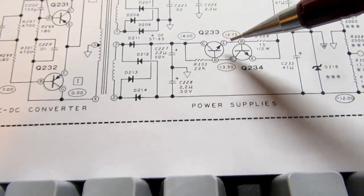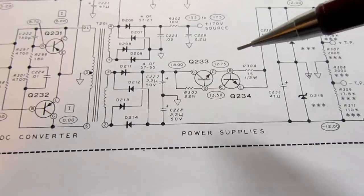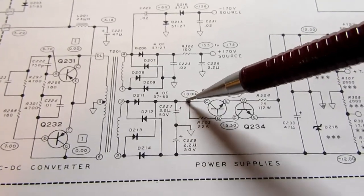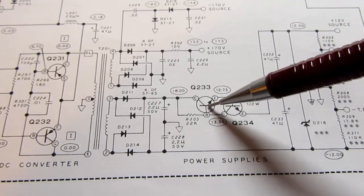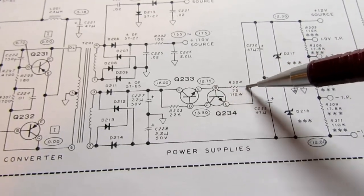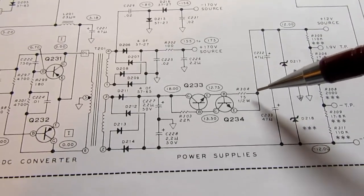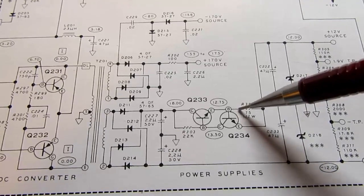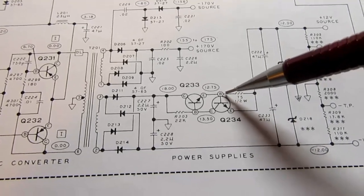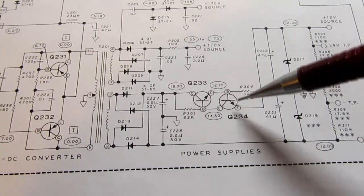And then there's this interesting circuit with 2 NPN transistors connected in this way. We have to assume that initially, since there's voltage here, that goes through this resistor and turns on this NPN transistor. Therefore, it conducts, and its current goes through here and on out. But if the current gets too high through this resistor here, then it develops a voltage across it, and that voltage developed here is placed across the base to emitter junction of this transistor, starting to turn it on.